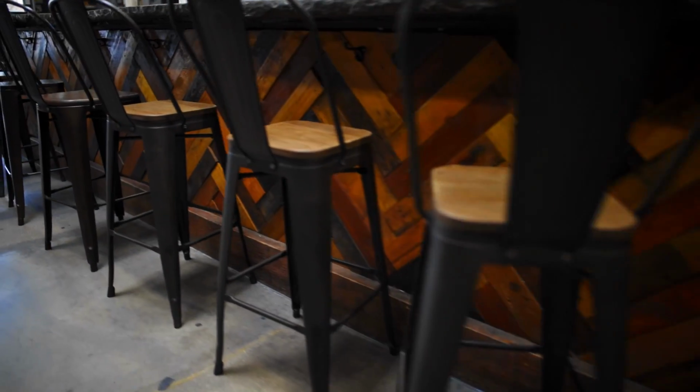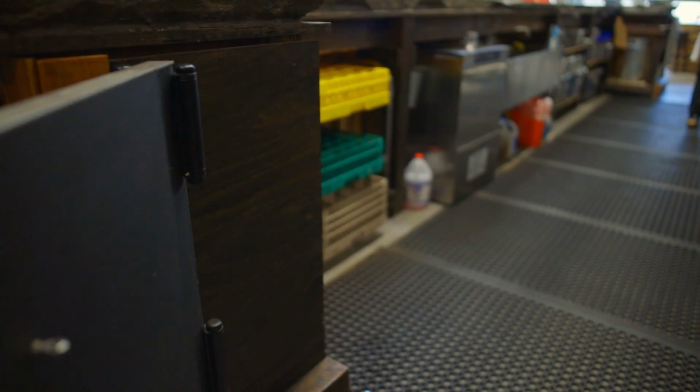So how did you build the structure? Is it wood? Is it metal? What do you got going on under there? So below, the framing is 4x4 posts with 2x4 supports, joists. The sheathing, which is a standard 3/4 ply, followed by old pallet wood. Again, an interesting way to incorporate used materials here for a lower cost, but really creates a lot of character. Yeah.